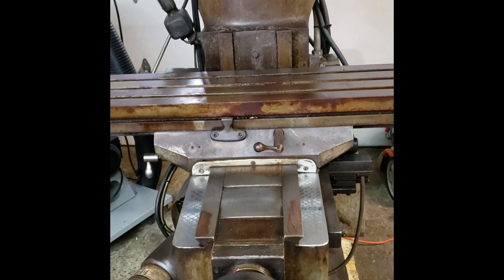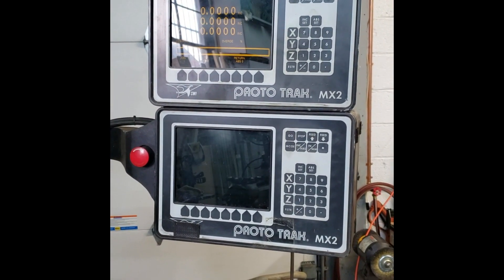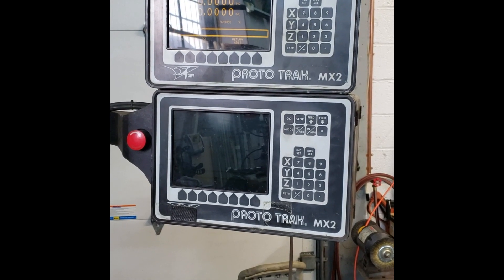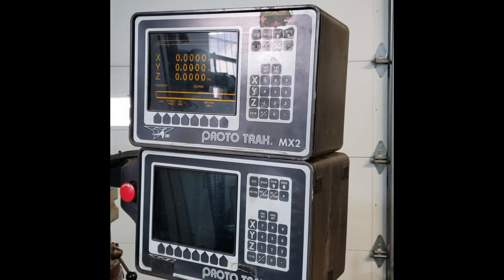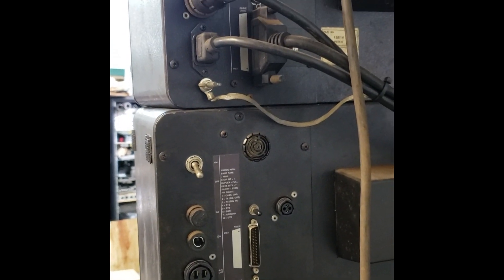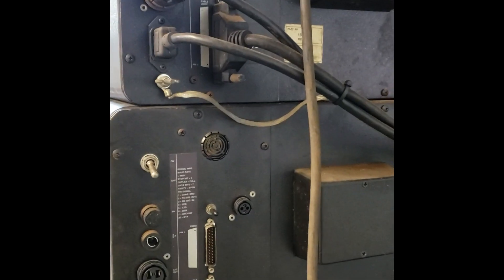As soon as she came in, I needed to plug her in — to see the spindle work, and to see if the actual Prototrack system functions. You can see there are two pendants. The bottom one is the original pendant — I powered it up and got no power, nothing lit up. I heard the computer running, but that was it. Fortunately, I had gotten a box of spare parts including a whole other computer and a whole other pendant. So the first thing I tried was swapping out the pendant, since I heard the computer running. This runs off a floppy drive. The swap wasn't very hard to do — there was a DB25 and two power cables and a ground, and a little jogging button that takes you to the next step in the program. So I swapped those out.